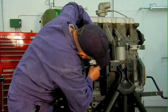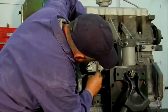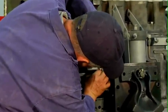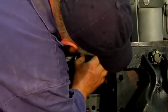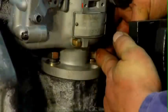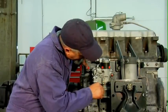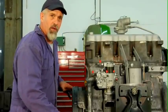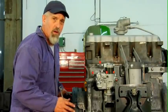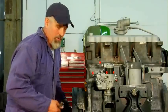Now go ahead and put on the washers and the nuts, and once we get those positioned, we can do the final static timing before we tighten them down tight. Got my timing mark lined up, so I'm going to snug the bolts up just enough to hold the pump. I'm going to roll the flywheel backwards about a half a turn, and then bring it up again to four degrees before top dead center, and then we'll recheck the timing window in the pump to make sure that we're accurate with our timing mark.